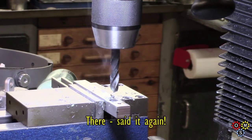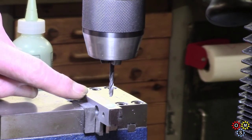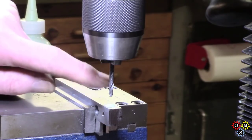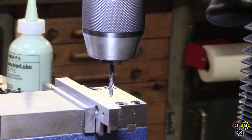Let's move this around and set up for the pinch bolt in the right place. Having got this oriented correctly now so we get a pinch — this is a piece of 5/8 by 1/2. The sides have been cleaned up on the belt sander; both ends have been done on the vertical mill just to tidy them up. There's no real pretense at Rolls-Royce here, as I so often say — it's functional.